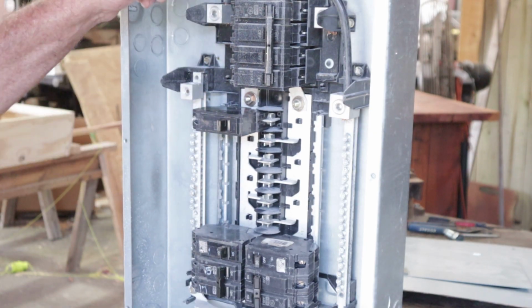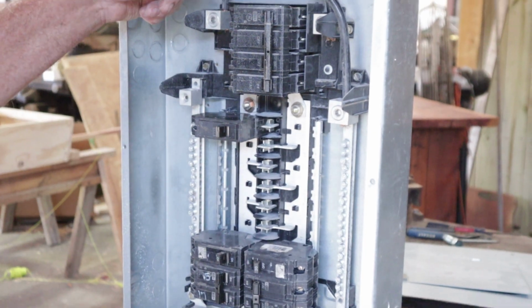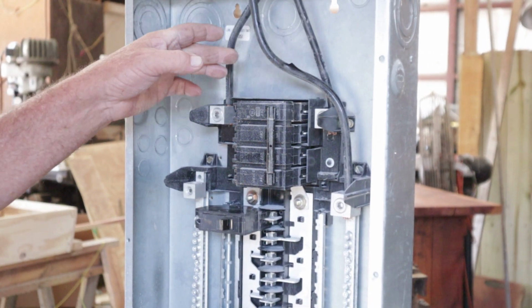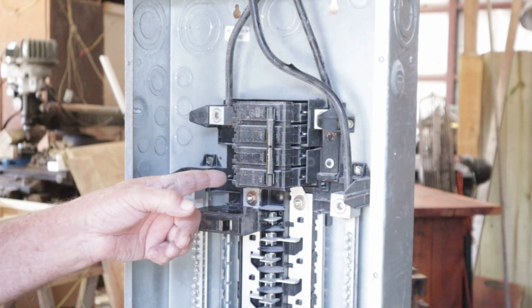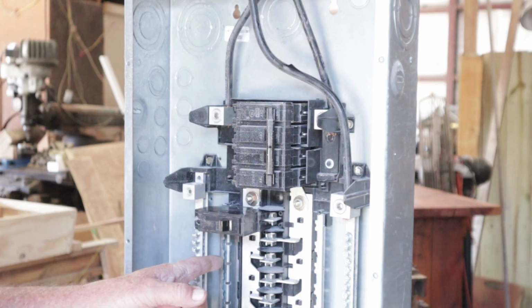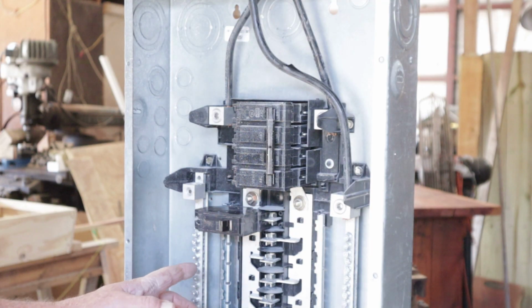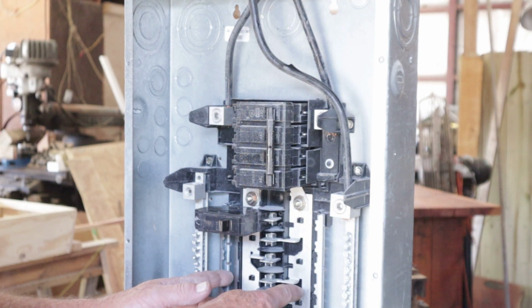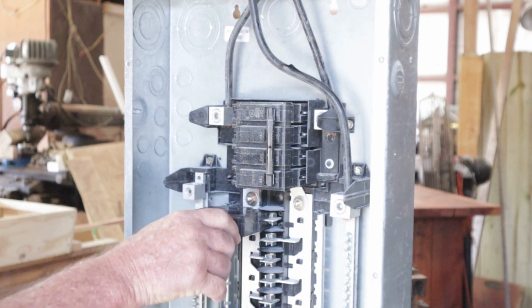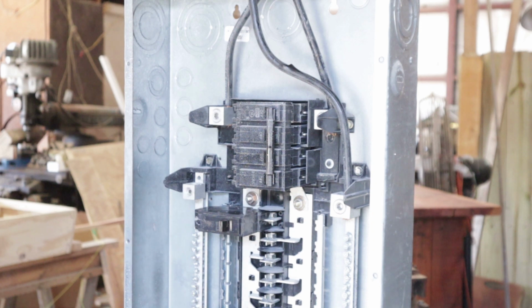So that's going to send you 110 volts coming from, or 120 coming from here, 110, 120, coming down this leg, through this main breaker, down this leg on the left side, which is half of what these two combined would be, which is 240. So this would be 120 coming in here. So 110, 120 on, say, a light set of plugs in your wall, ceiling lights or anything that takes 110, nothing that takes 220 or 240 volts.